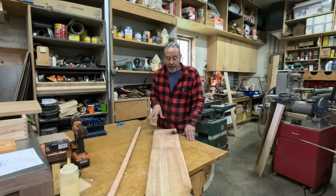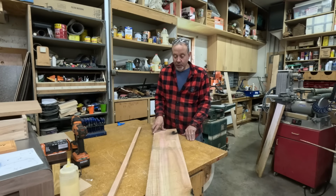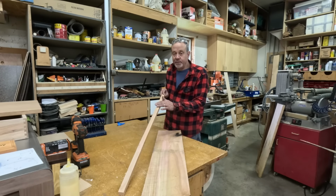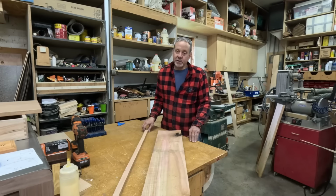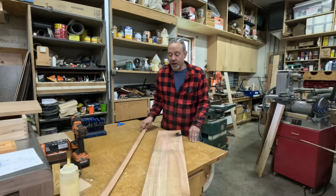So, again, species of wood does make a difference. I like to stick with poplar, it's a good choice, and also cherry. It doesn't seem to react with other woods. Maple's very finicky when you try to sticker it. It'll mold it. It gets sticker stains real easy. Oak sometimes can be a bad choice, but we do have thousands of stickers made out of oak.